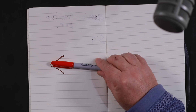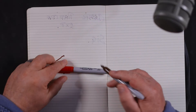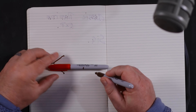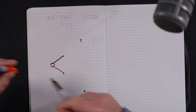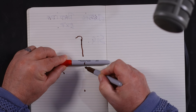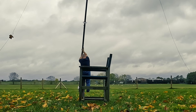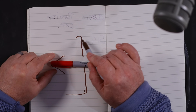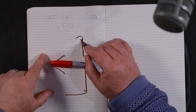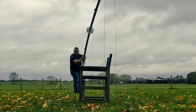Some of the bases I've made are just a little bit of aluminium tube that fits fine into the base — obviously take the bottom cap off. You can also drape guy lines around the pole where your main guys will go, do a test deployment, lay the pole down, and you'll have an accurate point of where the guy is going to go. If you're single-handed, just put it on your shoulder and do the guys up.